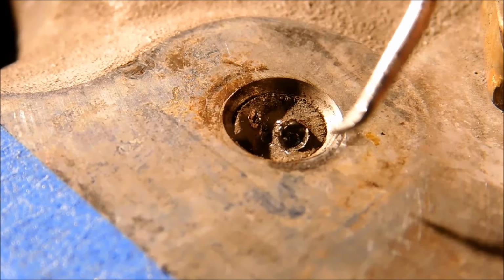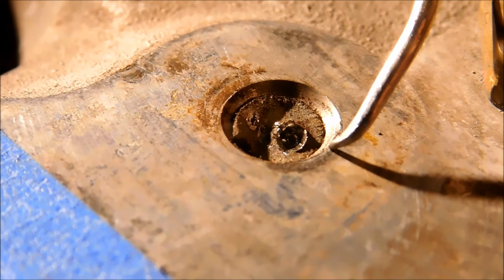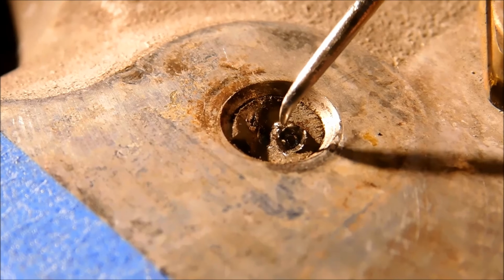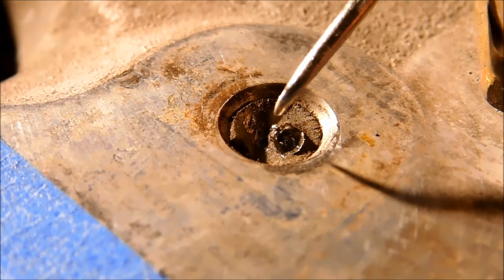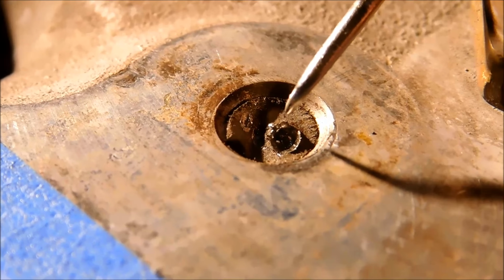This is ideal to have a nice clean countersink available to you. So whatever you have to do to line up to get your machine on center with that, do it. And be careful that the center drill doesn't hit some of these high spots and walk off as it's trying to get down. If you see any movement in the center drill, by all means, dust this with an end mill first, and then center drill it, and then go down the center.